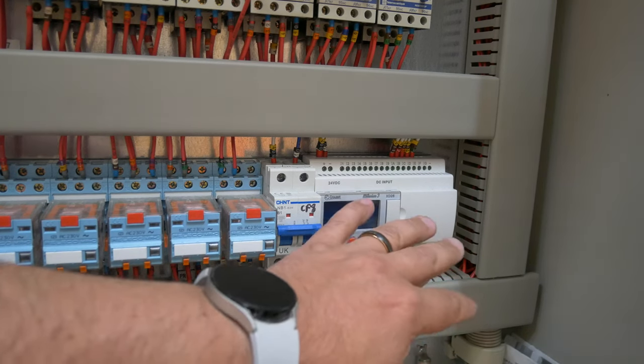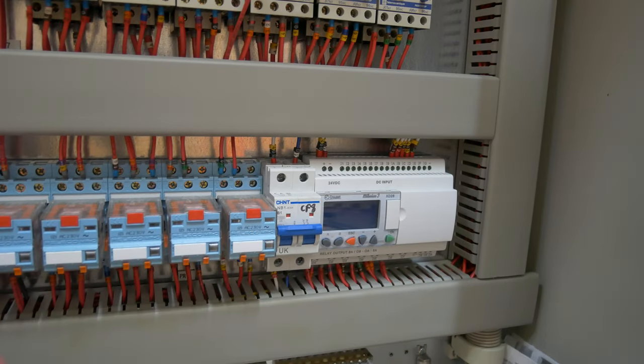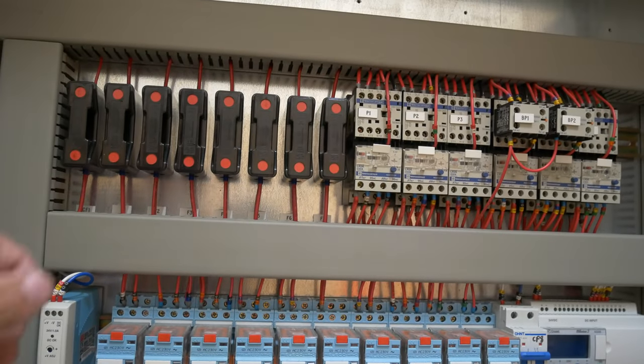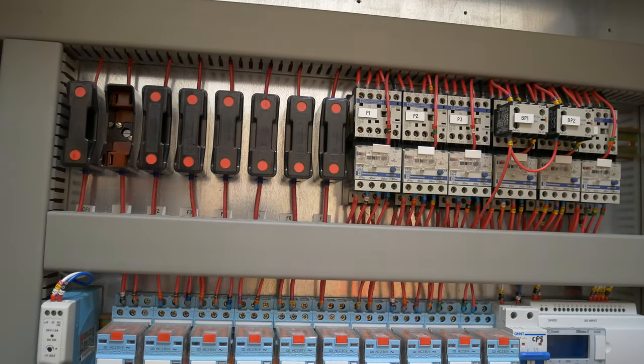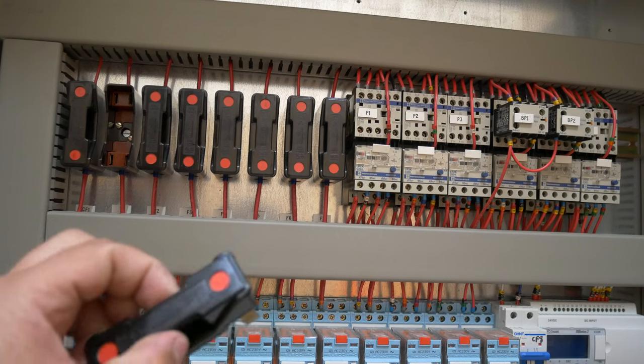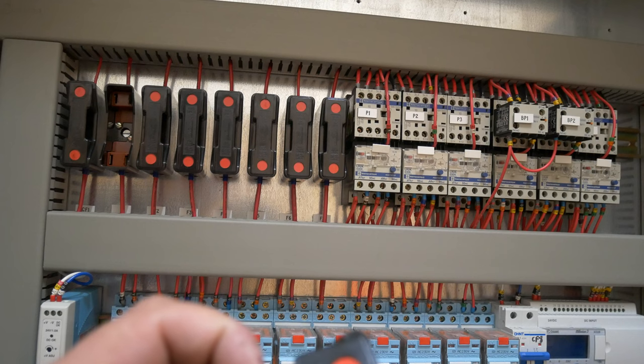You can see at this side we've got the DC relay controller. We've got positive and negative into the top bringing 24 volts DC in, DC inputs on the top which make certain events happen with this relay, and our outputs off the bottom which essentially join a contact to switch something in or out. Today we have multiplex controls and all sorts of other fancy bits of equipment that go in these BMS panel boards, so this is old tech essentially, but the same principles underpin everything. On the top row we've got our red spot fuses - these are GE Power Controls fuses.